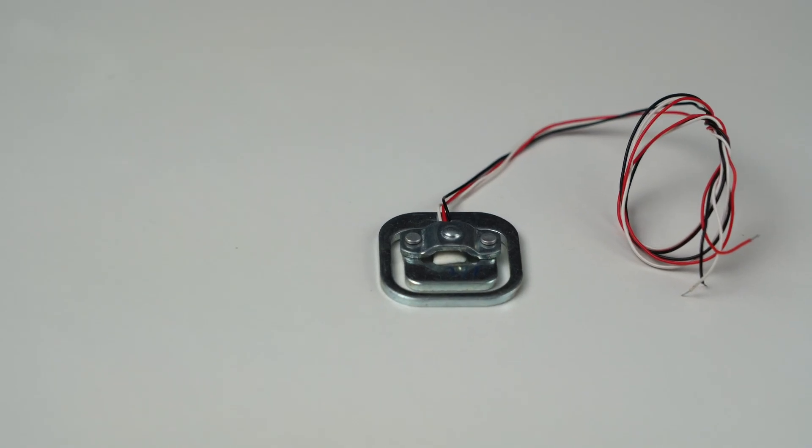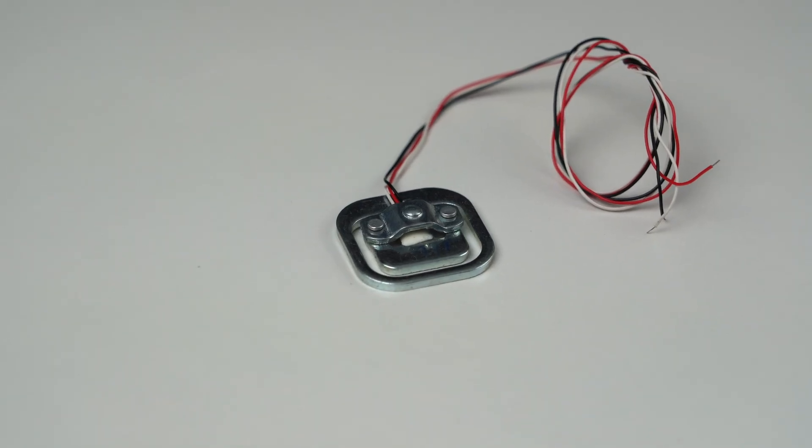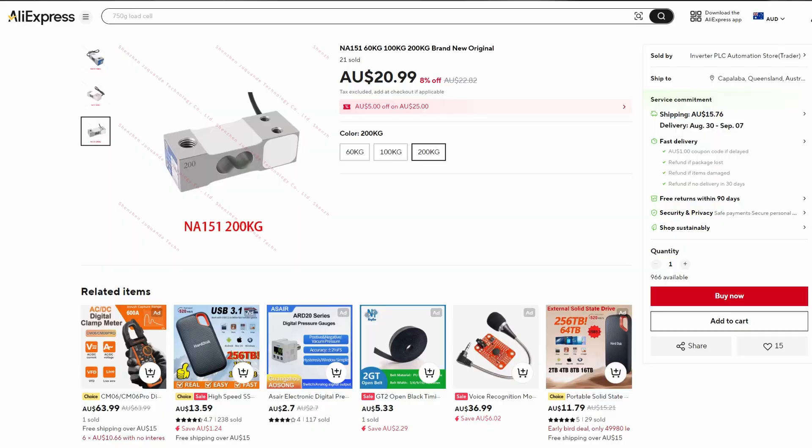For the sake of keeping the design practical, we'll need to keep the load cell pretty close to the bottom of the lever, meaning we'll have quite a bit of mechanical advantage over it. These little 50kg load cells are a tempting option, but with so much lever it would only take about 10kg of force applied to the handle to max out the sensor, which might not be enough and would likely damage it if pulled too hard. The NA151 cell I used on the pedals has a rating of 200kg, and even though it's considerably more expensive, it's still one of the next cheapest options. The 200kg load rating should mean I'm safe to apply a bit over 40kg of force to the handbrake, which should be more than enough.